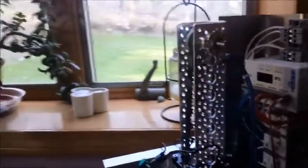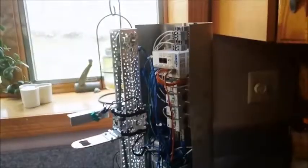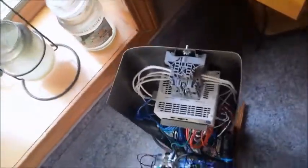The basic frame is made out of pre-fabricated and pre-drilled aluminum segments sourced from servocity.com. The back panel is simply a piece of steel bent into a U-shape, which allows all the components to fit on the inside. There is a piece of DIN rail running along the back which houses all the terminals, the PLC, and the relays. The ON switch is simply screwed into the side via a cutout capped with a diamond plate cover.